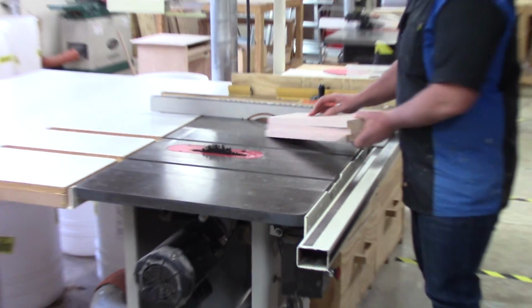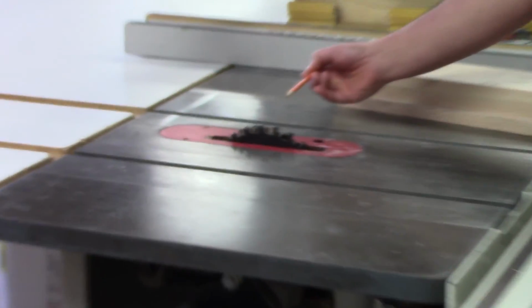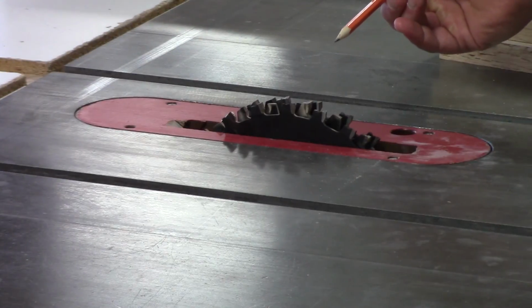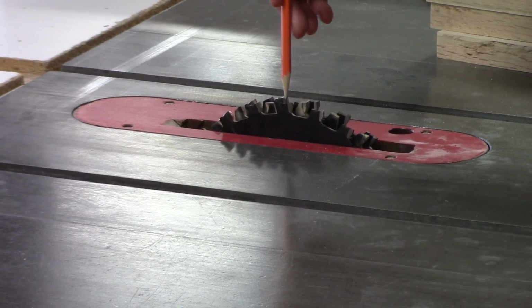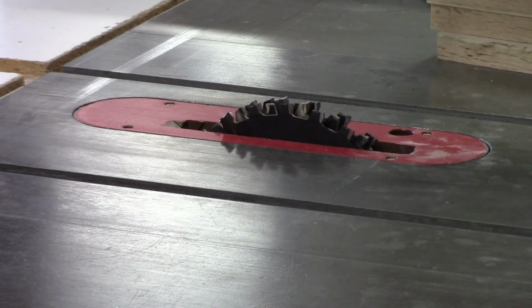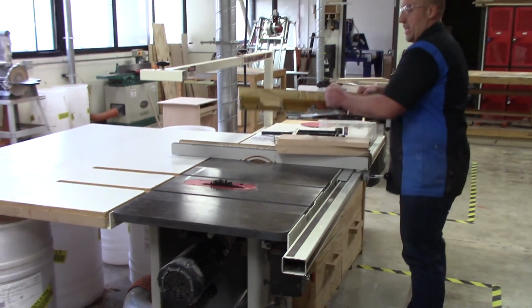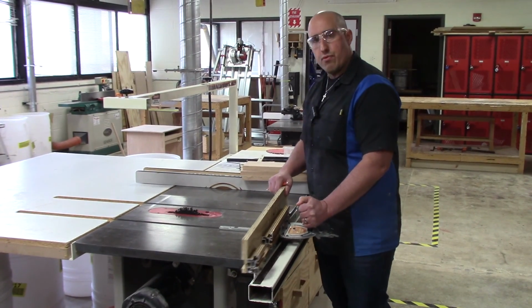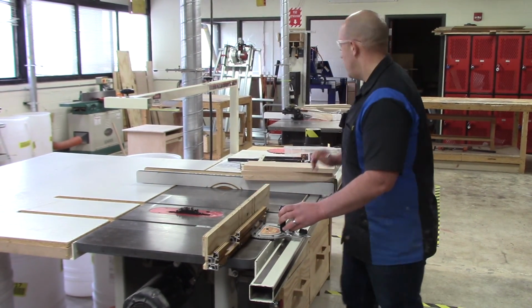Make sure your dado head is set up at 3/4 thick, 1 1/8 high. We do not have a 1 1/8 inch block, so you have to measure with a steel rule from the throat plate to the top carbide. You will be using our miter gauge that is pre-set up for cutting these specific notches.